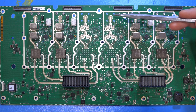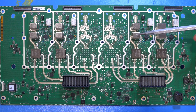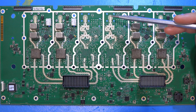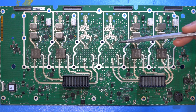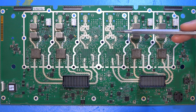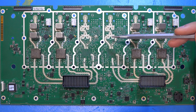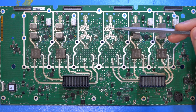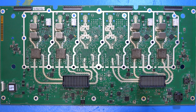If you look at the way the analog signals are dealt with, there's a lot we can learn, especially from the unpopulated channels. The BNC input comes in and gets transformed into a coplanar waveguide, then encounters two electromechanical relays made by Teledyne. From the BNC input all the way to the first IC, the signal has to remain as linear, as low noise, and as high dynamic range as possible — going through solid-state devices makes that quite difficult. This instrument supports 50 ohm and 1 megaohm simultaneously, so we need a way of switching between them, and because the high-speed path has to be well-maintained, an electromechanical relay is used.